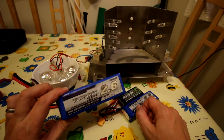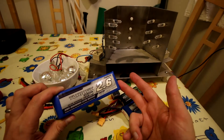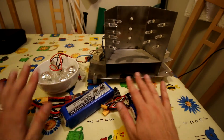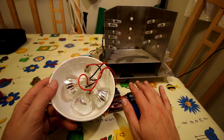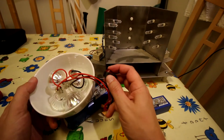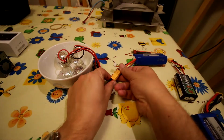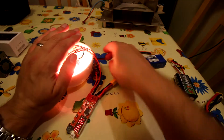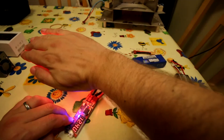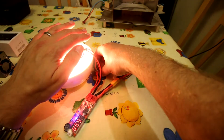The other problem I had was when I moved up to bigger 6s packs. I was flying 5000mAh packs in my big heli and the carbon cub plane I crashed. My original solution was the 'bowl of death' - light bulbs from the pound shop connected into choc-blocks with a switch, so you could run either two or four depending on how fast you wanted to discharge. It worked but was terrifying - got absolutely red-hot, and I had to sit and watch it with a battery alarm, leaving long cooling periods between packs.